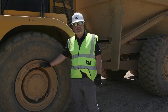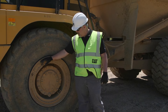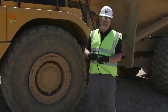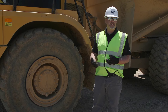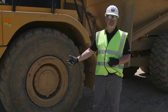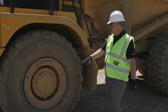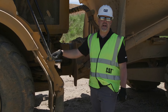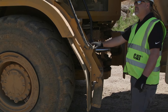Now talking about that lock ring — I always want to make sure the keeper is in there, as that's what's going to hold it in. I also want to go around and look at all my bolts. We don't have to reach in and touch every one of them, but a good indication is: if I've got dirt around them and one that doesn't have any dirt, that's a good indication it may be loose. Or if I see rust streaks or anything shiny behind there, that's going to let me know maybe I've got a loose lug nut. As I come back, I'm looking at my steps and handholds, as they allow me three points of contact when I climb up this machine so I can be safe.